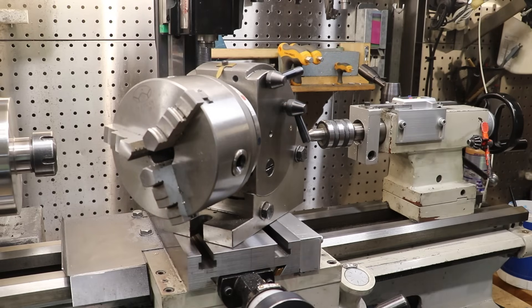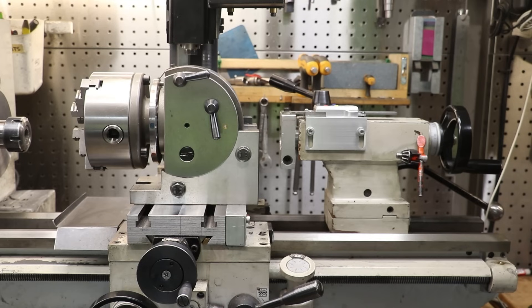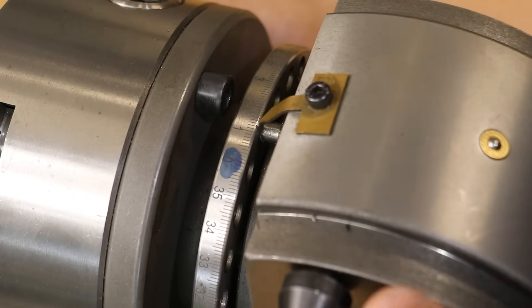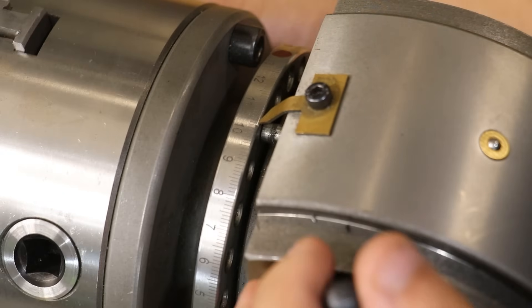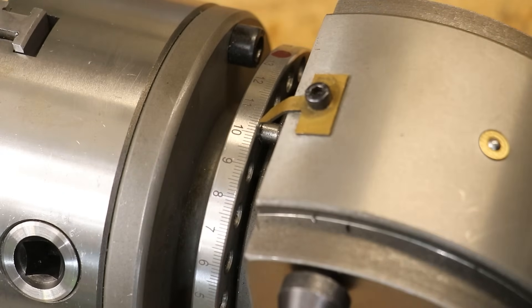What I'm going to attempt to do is attach the dividing head to the back of the lathe. I guess this sort of sounds crazy on paper, but just looking at them now, the dividing head looks pretty similar to the tailstock. And I guess it's not too different to one of those rotating tailstock chucks that people make. The thing is though, if I do it, it does solve two of my problems in one setup — it means I can hold the part and hold it steady because the dividing head does have a spindle lock. But I can also use the indexing ring to index the part. And if I can get that to work, that is job well done, because that's all it really needs to do. And it really only needs to work for this one setup.